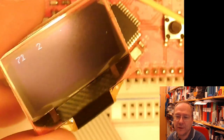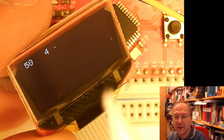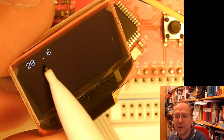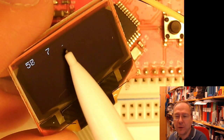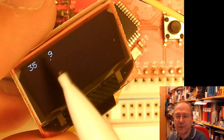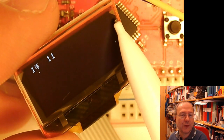Here it is. Oh, there. And you see this tiny spot running around here. I showed this in one of the Q&A sessions before, but I didn't record it. So this is the X and Y position on the screen. In this part of the code, it sets a single pixel at all of the 128x64 positions on the screen to just demonstrate the use of the set pixel and clear pixel functions. So you can try to chase this.